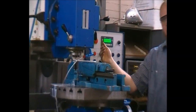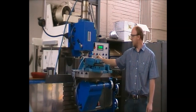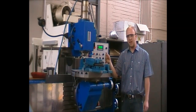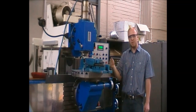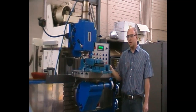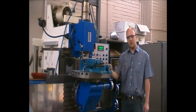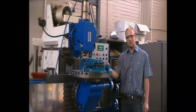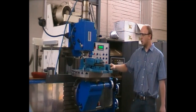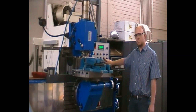A single cut of 0.5 millimeters has now been taken. If the desired finish is not yet achieved, another half to one millimeter cut can be taken. The general rule is no more than a third of the diameter of the cutter may be used for any face or side cutting.